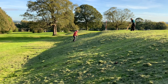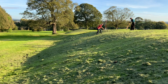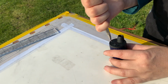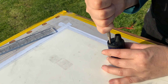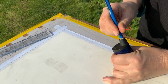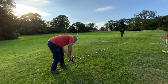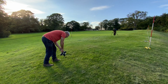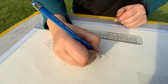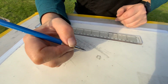And in terms of accuracy, at the normal scale of 1 to 1000, measuring to the nearest tenth of a metre will be sufficient, because it's almost impossible for the person doing the drawing to draw finely enough to differentiate tenths of a millimetre, even using these special super precise German pencils and sharpeners. So don't get too worked up over whether a top is at 11.6 or 11.8 metres. Such minute differences are unlikely to change the outcome of your analysis.